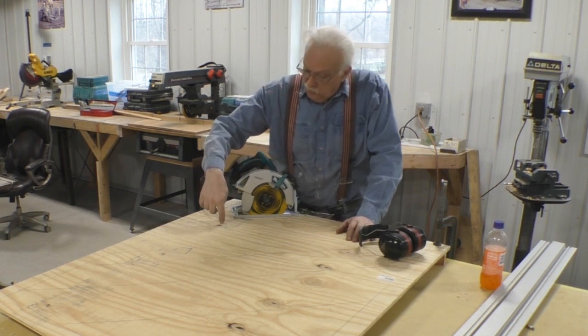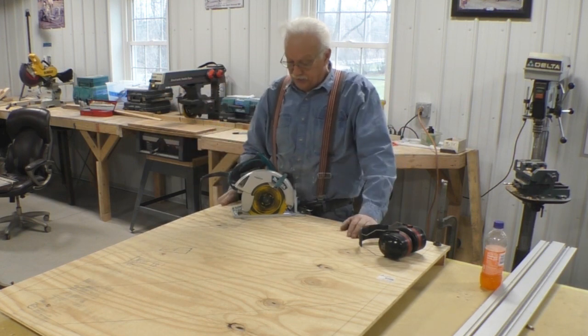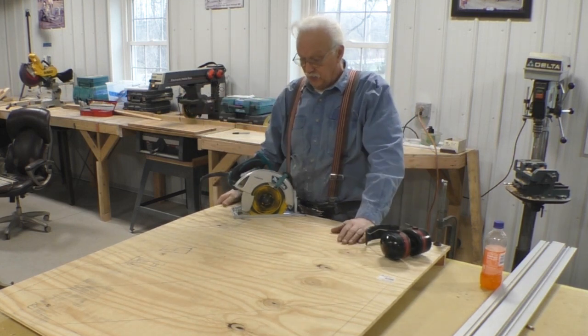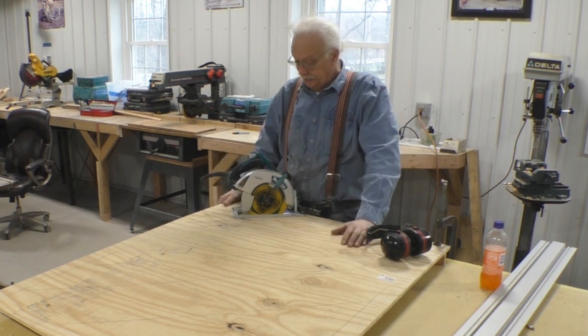I'm putting more slots in the corner where the dust is going to tend to collect, and fewer slots as you go further out because you're directing it into that corner. Hopefully that creates a better suction area.